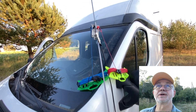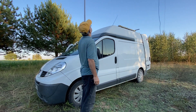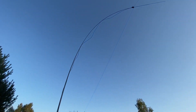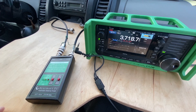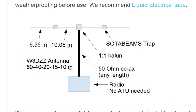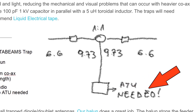It's going to be around 8 meters up in the sky. This video is my second experiment with the W3DZZ antenna. The first time it was tested with the ICOM IC-7300 and its internal antenna tuner — results were mixed; link to that video is in the description. This time I'm curious about the ICOM IC-705 and the QRP tuner Elecraft T1, and I'm in a different location with a different antenna setup. The SOTA Beams website recommends certain antenna dimensions claiming no antenna tuner is needed on five bands, but spoiler alert — the tuner is very much welcome.